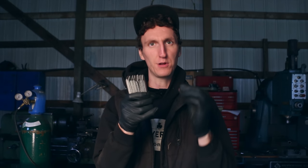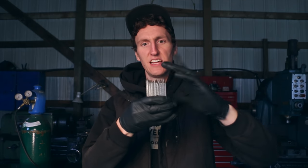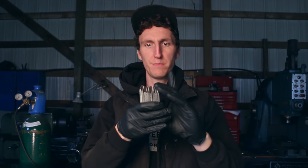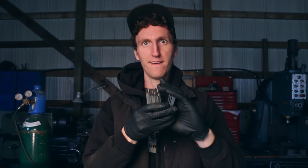And the feather Damascus is just a style of pattern that we're going for. So I'm just gonna now clamp these in the vise, TIG weld across the top and the bottom, just to hold it together so that in the forge we can heat it up and then put it under the power hammer, which is gonna be awesome. Looking forward to the next couple steps here.